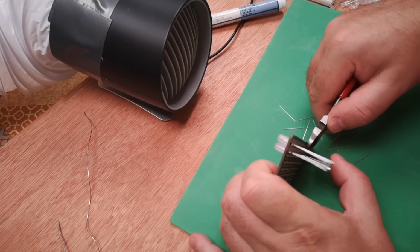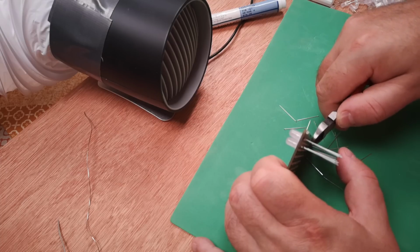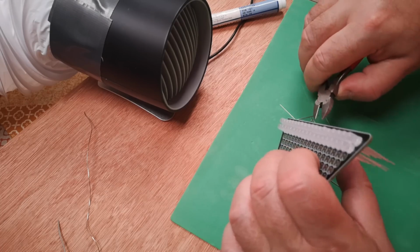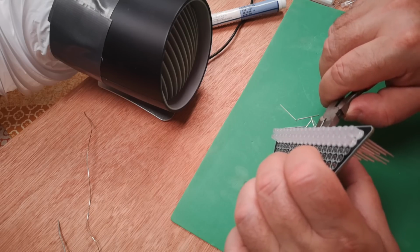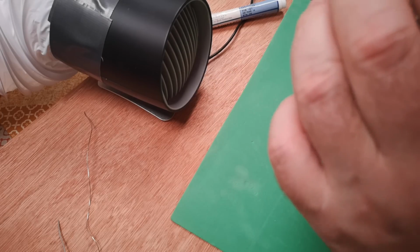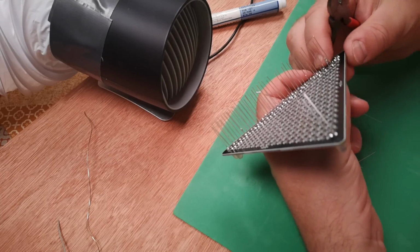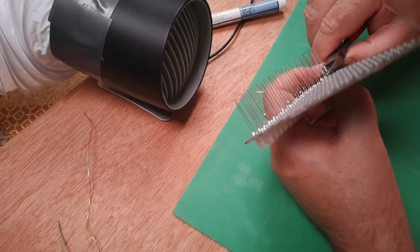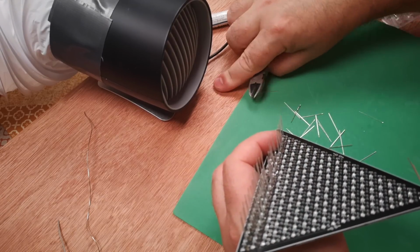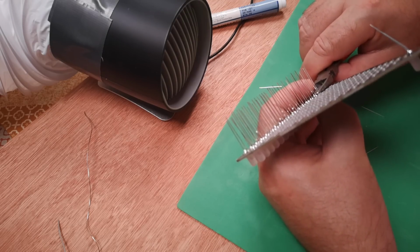This is not like soldering to bare copper strip board. These manufactured PCBs are a kind of different material, and the solder mask they put on here, I don't know, I feel like, and I don't want to be again the guy who blames his tools, but I feel like the pads were kind of resisting me a bit in places. I might need to come back and trim those a bit more, but we'll see. But yeah, you can see in some places, and I make no excuses for this, the solder just seemed to want to climb the legs of the LED rather than go down onto the pads. Really weird. And I was applying the heat to the leg and the pad simultaneously, but the solder wanted to go up rather than down.